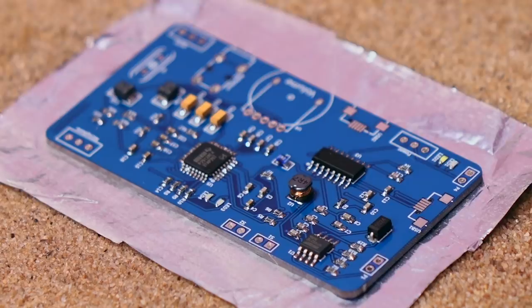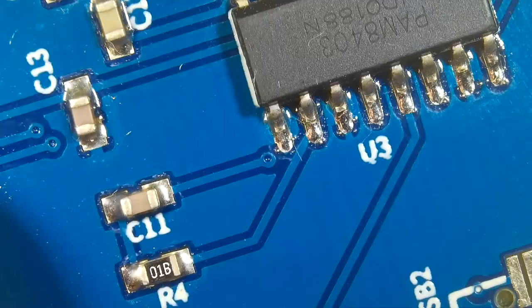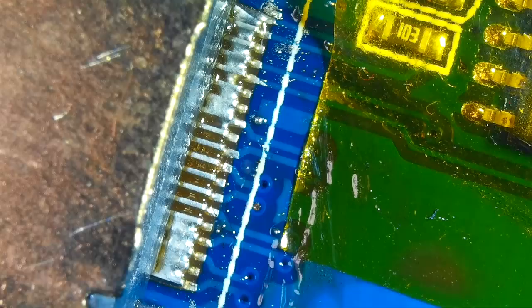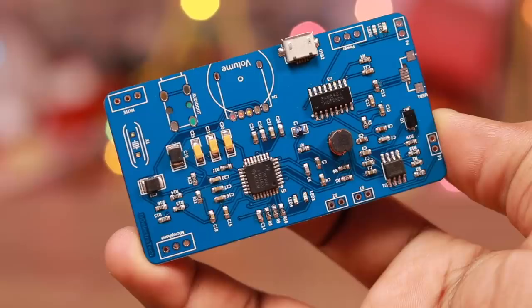When the soldering is complete and the circuit board has cooled, inspect it to see if everything looks okay. Look for solder bridges, misplaced components, and bad or non-existing solder joints. In case of a solder bridge, use solder wick to remove excess material. Look how perfect it is — almost equal to the standard of a pick-and-place machine.